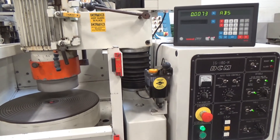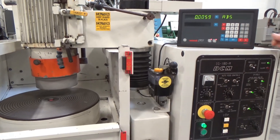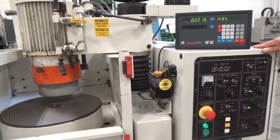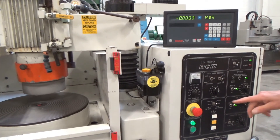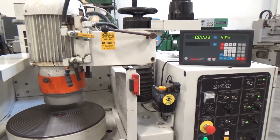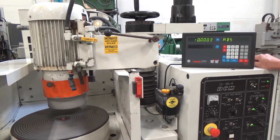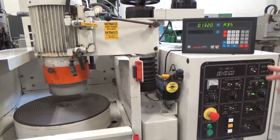Really slow. We can pick it up a couple notches — a little bit faster. Going up to number five, or about half speed in this case. There's our zero — now it's blinking, so we do our 30-second dwell, sparking out. At that point you'll see the wheel back up to about an eighth of an inch — 127, 128. That's user-settable off the PLC pots. The auto cycle completes and retracts.